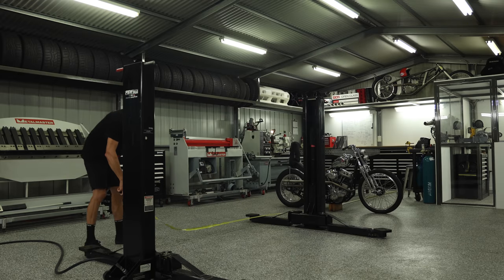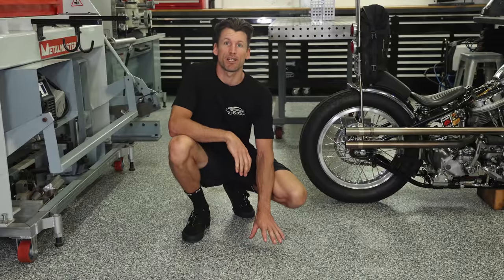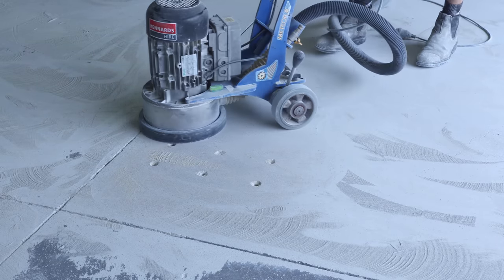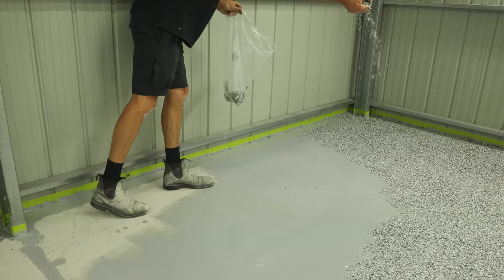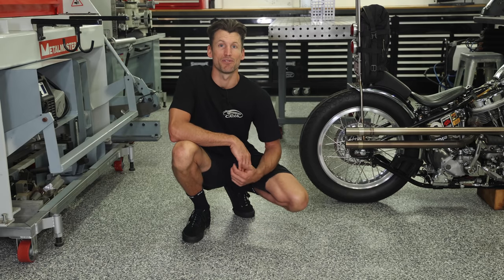One of the most asked questions is the overall size of the garage. It measures 12 meters long by 7 meters wide, and the eaves are 2.7 meters tall, with the pitch in the middle at 3.4 meters tall. The floor coating is an epoxy flake floor finish that I did myself — you can see more details in a blog post on the process. It involved grinding the floor back to smooth concrete, putting a base coat of neutral grey down, applying flakes on top, then covering it all with a clear coat. Having a clean and well-presented workshop floor is worth it, even if you do drop and lose a few bolts from time to time.